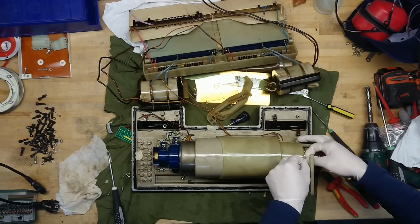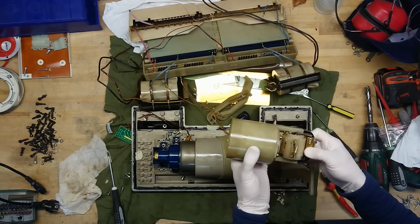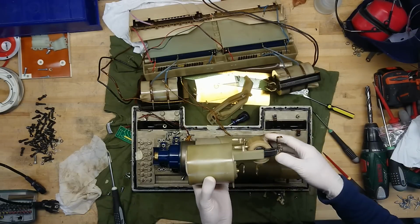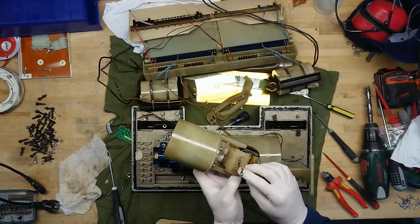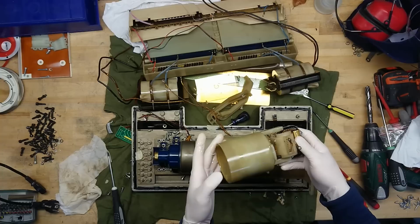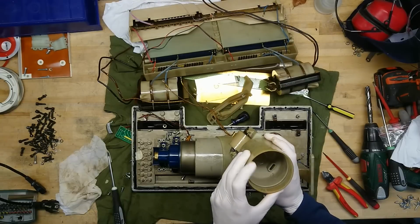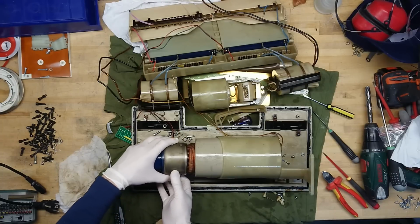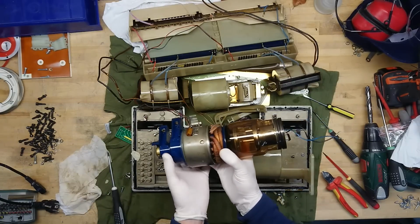And we can talk about all the power supplies and such afterwards. Now this is the filament transformer. This is what supplies the, it was sitting with two small banana jacks there. I see in here, it seems like it's 1, 2, 3, 4, 5, 6, 7, 8 turns of a silver wire maybe, or just silvered copper, sitting in a, I don't think it's a lead housing because it's not that heavy, so maybe it's just aluminum. But now we should be able to get it out, and here we have it, the whole tube assembly.